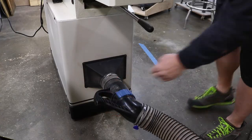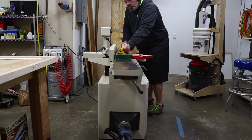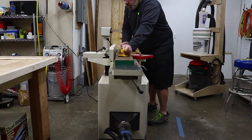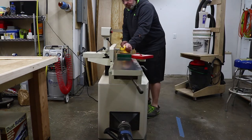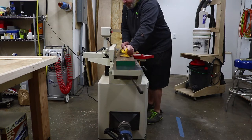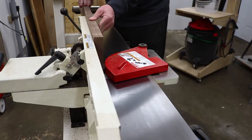If you don't have access to a joiner and planer, then you can buy pre-milled lumber or use construction lumber, such as a two by eight, which you can get at your local home center. The wood I bought was milled on one side already, so it was actually only about one and three eighths inches thick. I wanted the shelves to end up as close to an inch and a quarter as possible, so I was pretty careful with the milling.